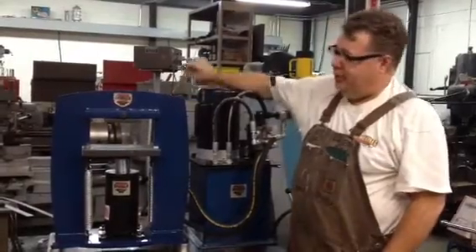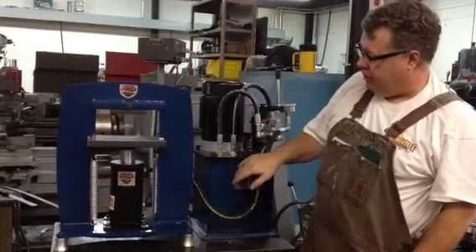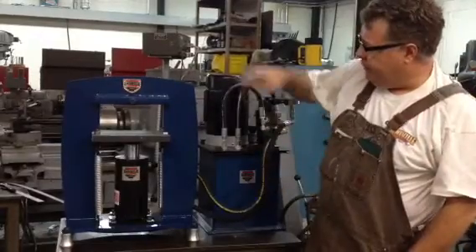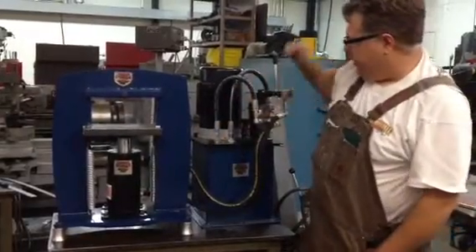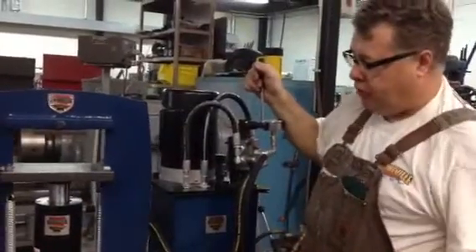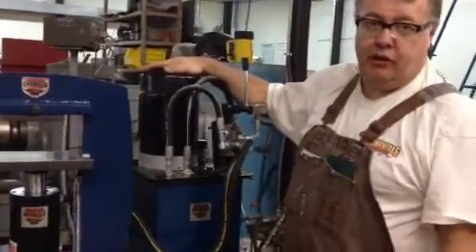Hi, I'm Kevin Potter, and this is my new hydraulic press system I wanted to make a video of. It is a 20-ton electric hydraulic system. It fits our standard frame, but we build our own cylinders and pumps. All the stuff on here is standard off-the-shelf industrial hydraulic equipment, except that I'm using a one-horsepower single-phase motor, so you can plug it into a 110-volt outlet at your house.